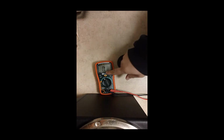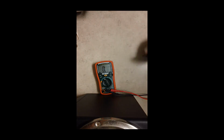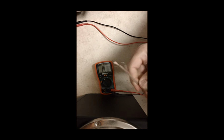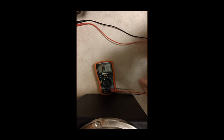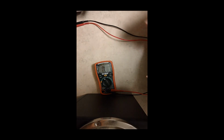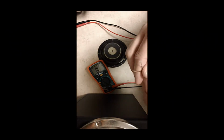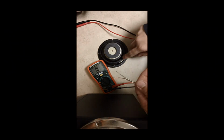What you want to avoid is the open loop. So this is good. The speaker's good, right? So what's going on then? Check the connectors. Now let's say inside of the monitor, these are the wires that are hooked up to the speaker, right? They won't actually look like this. They will actually look a lot better. They'll have the little clip-ons that clip onto the speakers.